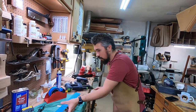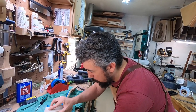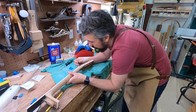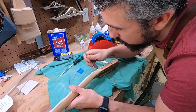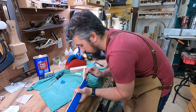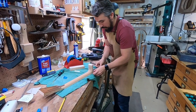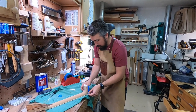You do it down here and then along the other end. I use this technique on any masking job I'm doing because it's just a really good way to get a perfect clean edge. You can use this technique with tape for all kinds of different processes. I have little baby files here — I'm just going to do the same thing and knock off the masking tape overhang off of the nut area. When I'm done, this stuff comes off and I'm off to the races — it's perfect. You either do the time now or you do it later, so I prefer to do it now. Totally sealed — I'll just do a quick same thing on the back side of this fingerboard.